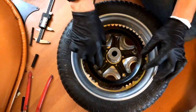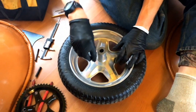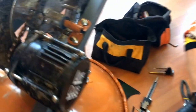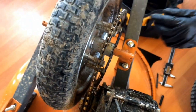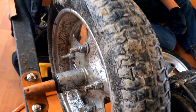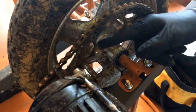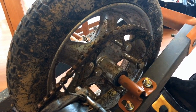On the inside of the wheel — this side — we're going to drill the holes even bigger. What we want is for the shank that goes around the outside of the bolt to go all the way through the wheel to the other side. You can see here they go all the way through and you can tack-weld around here for additional stability. You can't have the shim on one side and then just the bolt, because when you tighten it the wheel just crushes together and your chain ring will get wobbly. I did that initially with my first build and it ended up getting wonky — so I used washers to space it out so the chain ring doesn't wobble when you spin it.